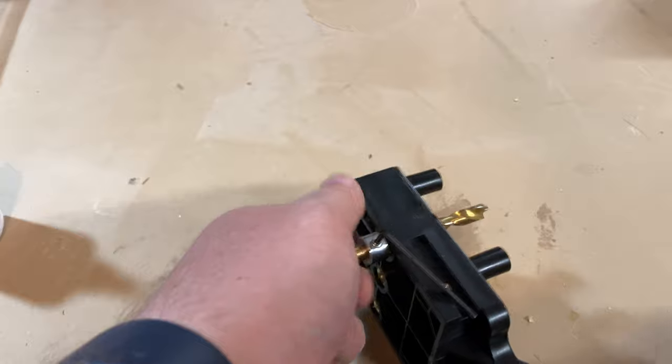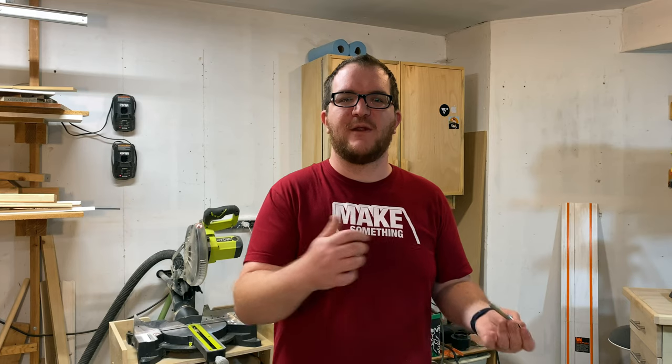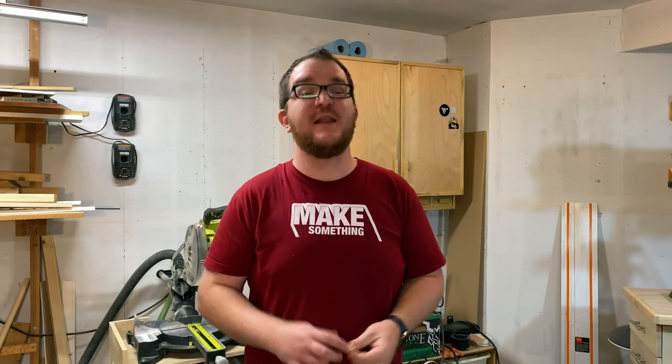There are some annoying things too. Setting the drill bit depth can be really finicky and difficult, and you usually have to change it for different sides of the joint. Because dowels are about an inch and a half long, if you drilled both holes the same depth you'd go through a three-quarter inch board. So on one side you set the drill to an inch deep and on the other side half an inch deep. I'll probably buy a second set of drill bits — leave one set at an inch and the other at half an inch and just swap them as needed.